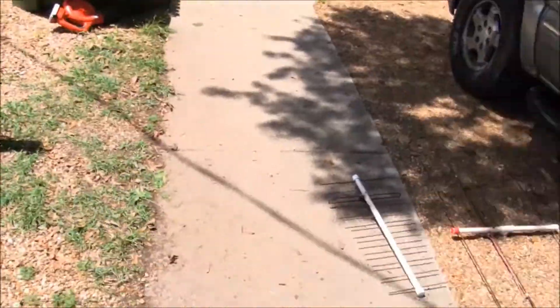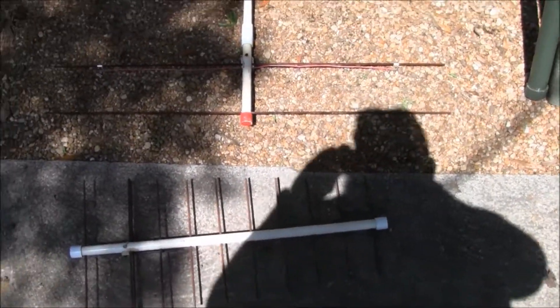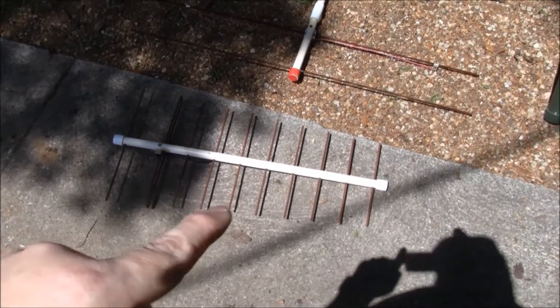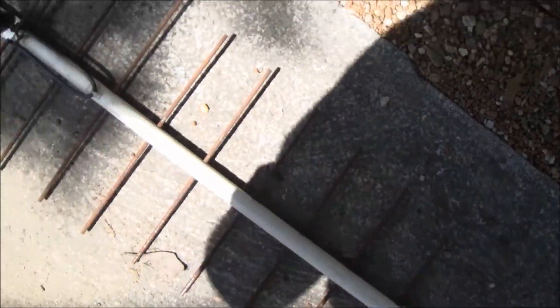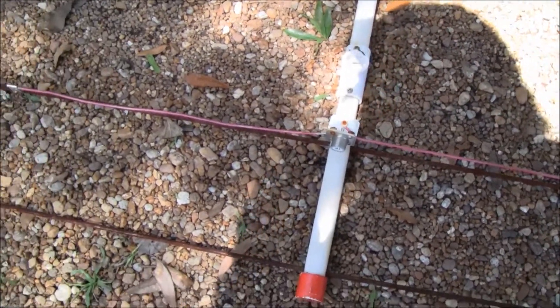So that's some of the things we're doing. This is a 440 antenna that a friend of mine built — it's just made out of welding rod and PVC pipe with what I think is called a stub match. Then this is a two meter antenna, a three element beam, and it's got basically the same thing — a little stub tuning match.